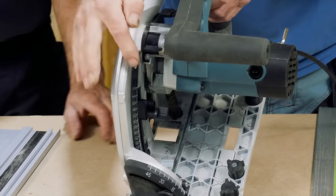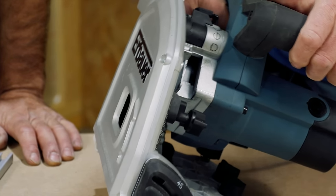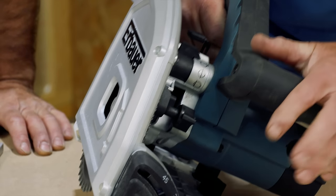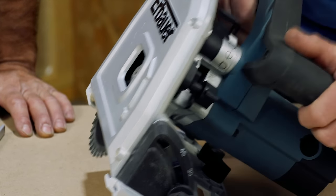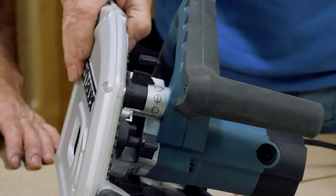The blade change: you go up here, select that on the top, press your button in, go down. You can see it's not locked — when you lock the spindle, that actually also locks the blade in place. Put the Allen key in the window, change the blade, slip it out. We've only borrowed this machine, so we won't touch it — but feel how robust that actually is.